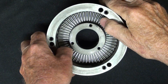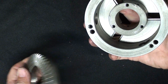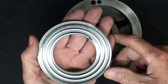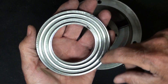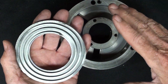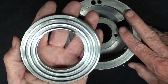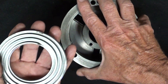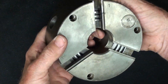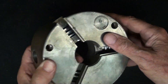And finally, by turning the chuck upside down, the scroll and gear will come out. Now expect a tremendous mess with grease and chips in here when you take this apart. In fact, this one was absolutely packed with chips in the scroll, and that can affect the wear and the accuracy of the chuck. So chucks really should be taken apart periodically and cleaned, because you cannot keep chips from getting in from this side — they're almost invited to get in there.